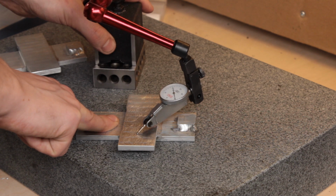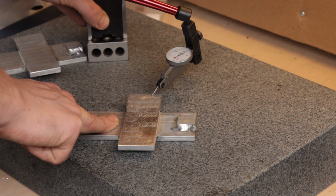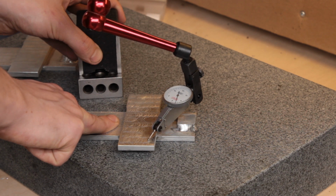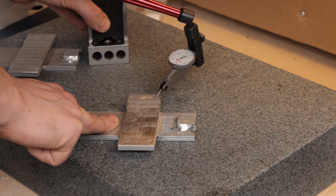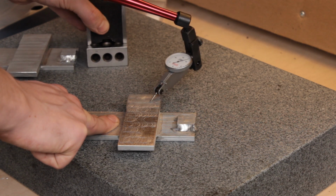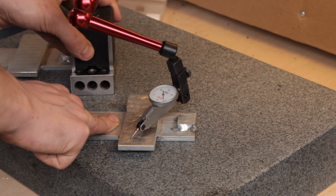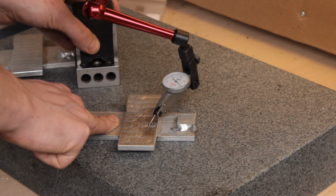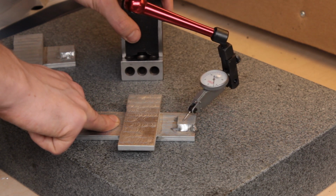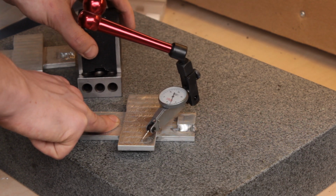warping during welding. Yeah, if you look at that, that's what, about 12 thou, give or take, 3 to 15 there. Does it quite hit 15? Yeah, not where the wheel would be though, so let's call it 10 thou, to be charitable. That is 1/4 of a millimeter, which is kind of suspect in my mind.